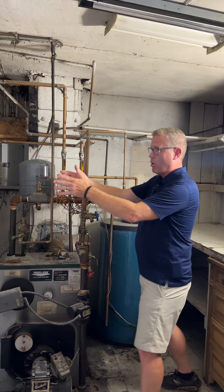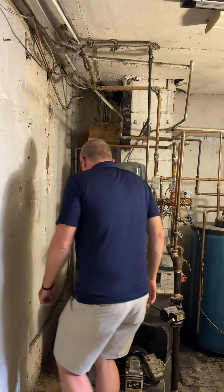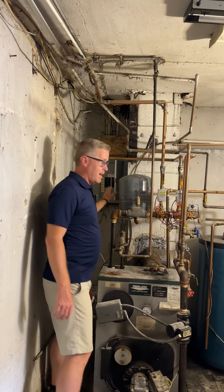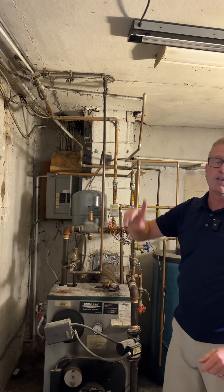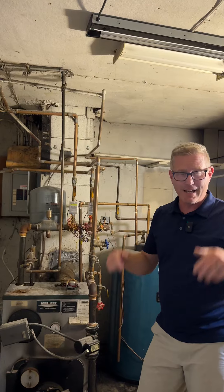And then on this wall — can you imagine getting to that electrical panel? You've got to squeeze past the furnace, not hit your head on the pipe, and then get to this electrical service. We're going to completely revamp that. It's going to be on this wall here. The wires will reach it so we can just tie them directly in, and we're going to draw a brand new service line to the house because right now it's under-amped for the services we need today.